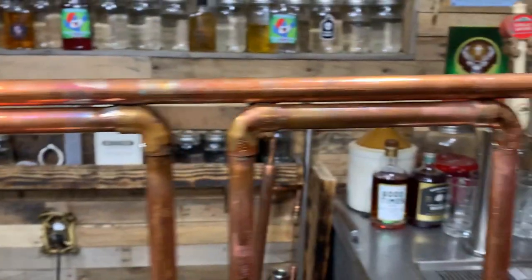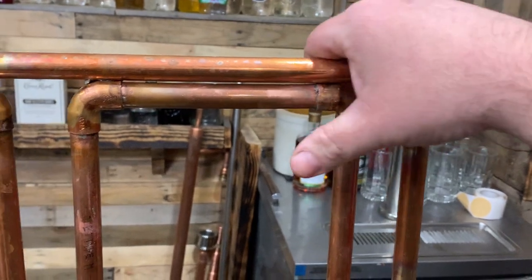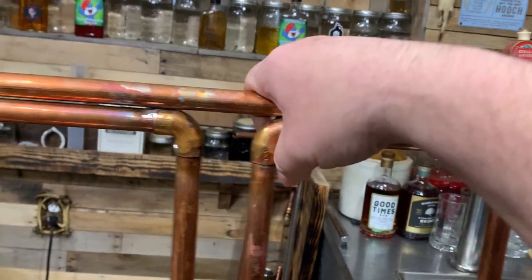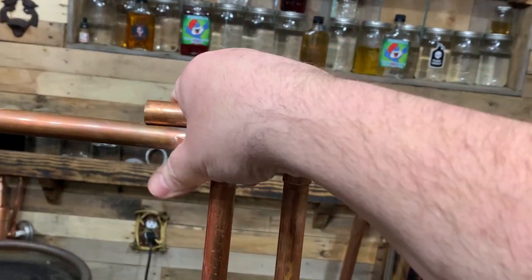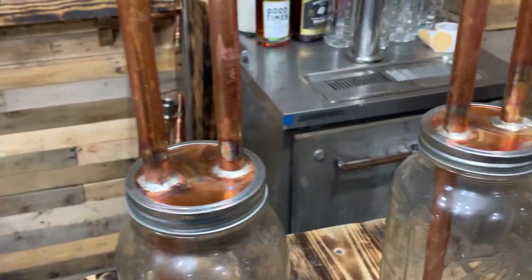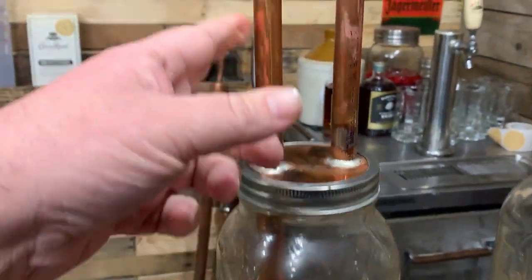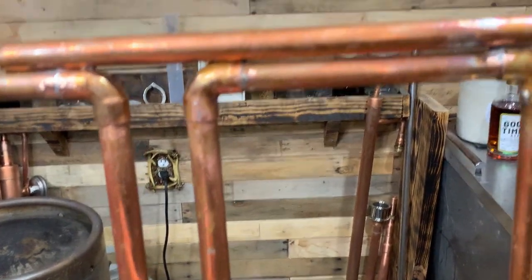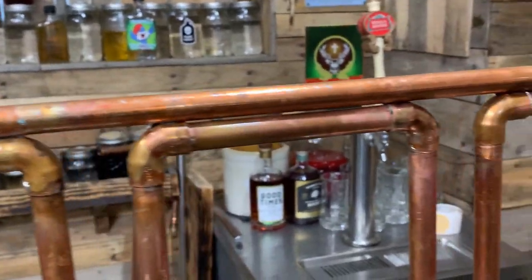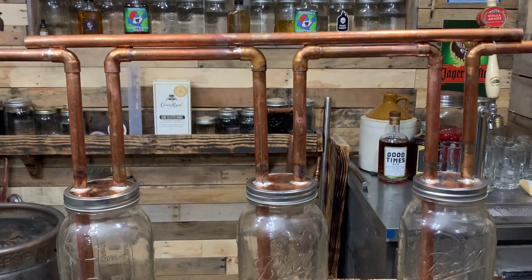Getting these straight is sometimes a hassle. I'll hose clamp here, put one here, here, here, there, there, and then just solder it up and straighten it up. I'll take a little level and level out this one, then level it out here, and then put all the rest of it together. Put this up top and it comes out pretty straight. That's one of the hardest things about half-inch.